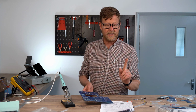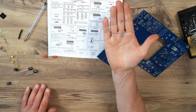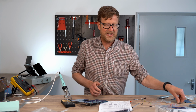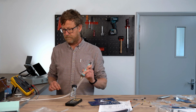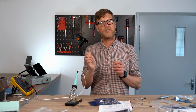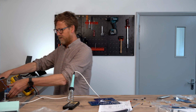What you'll also find is that you can see here we've got six resistors left. That's because they go on the other boards. It's just dealing with unit one. This is unit one. So we're going to solder this now, and get back to you in a minute. Oh, by the way, they don't provide solder, but I'm using the good old trusted Mundorf 3.8% silver gold solder. I'm going to get the fan on before I choke.